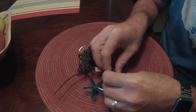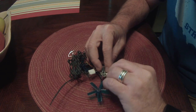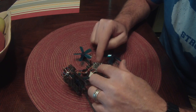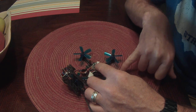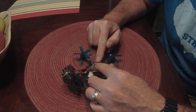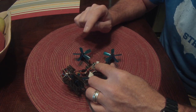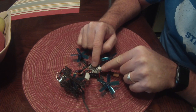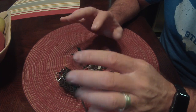Make sure your flat end is up on the wire, flip it over and work it around — it's a tight fit when you roll it but makes for a nicer build. Before moving past this step, double-check continuity on your flight controller to make sure you don't have any shorts. Plug in a battery, connect to Betaflight, go to the motors tab, and very slowly — with no props on — verify motor direction and motor order. When you spin up motor one, the flight controller should send a motor one signal to the ESC which should turn that motor.